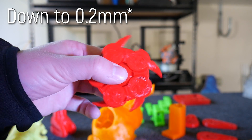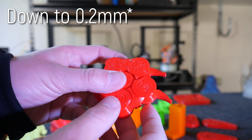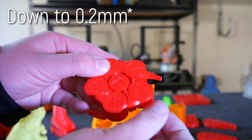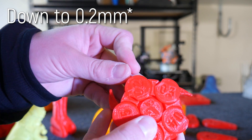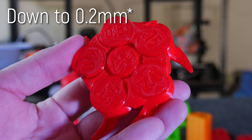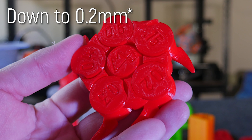My clearance gauge got down to 0.3 millimeter gaps, which is about expected. It's not the best I've ever tested, but only the very best well-designed and tuned printers get below this with a 0.4 nozzle, and I think most people will be content with this level of accuracy.